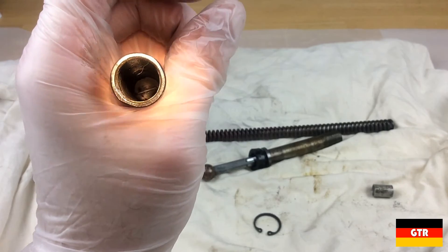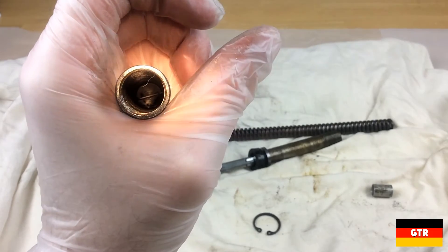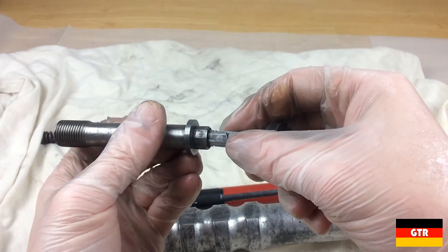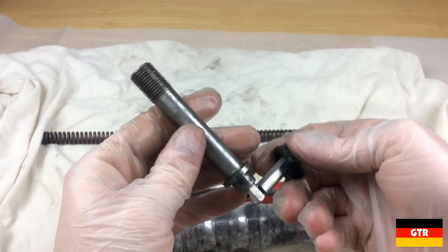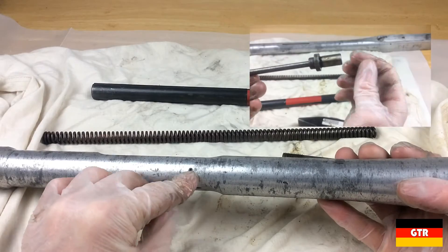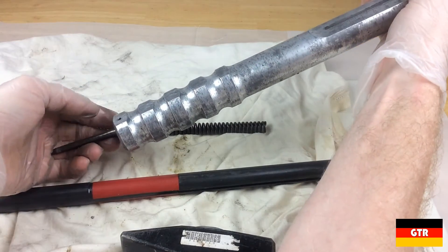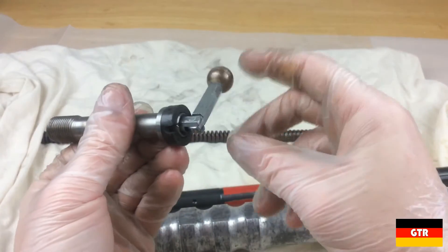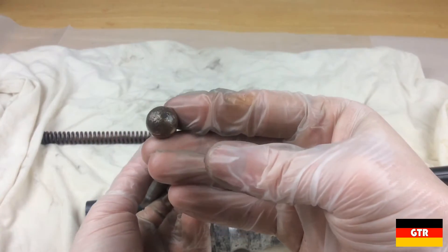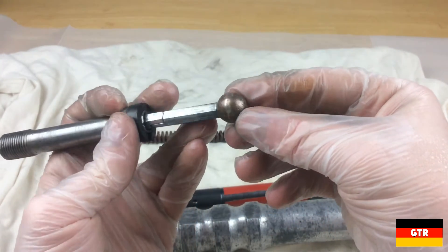I'm not going to mess with it right now because I don't have the equipment to calibrate the wrench. There must be some way to remove the hex shaft of this handle so you can access the screw while it's still together. I couldn't figure out how to remove it, so I'm guessing you need a special extraction tool that releases the adjustment lever and gives you access to that screw. There's still another piece left in the handle, but to remove it you need to punch out another roll pin that goes into the keyway of the spring shaft to prevent rotation when adjusting the torque. It is surprising to me that a single circlip would be able to hold that much spring force if you set it to the maximum torque level. There are a couple of roll pins at the end of the handle that I believe are inserted as a safety catch, but the ones installed were not long enough to engage. I'm going to replace these with a better solution when I put everything back together.